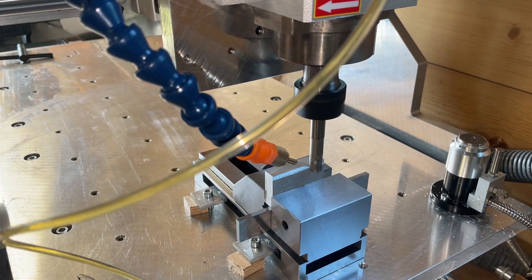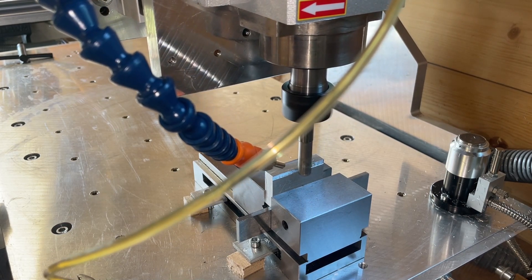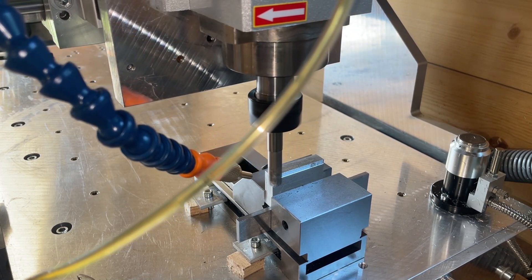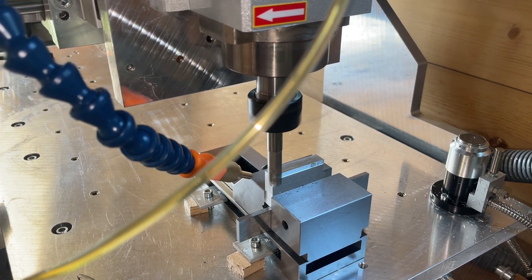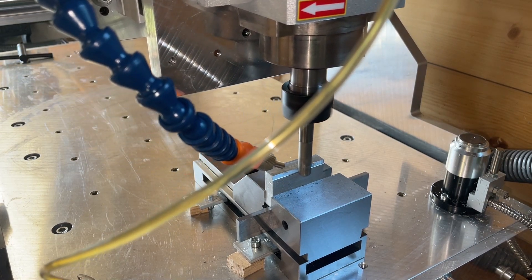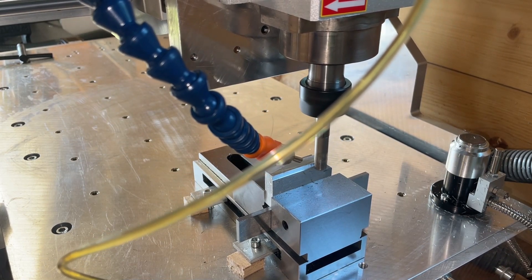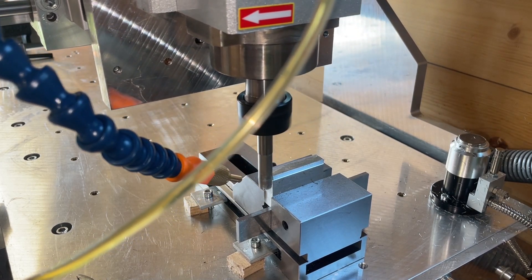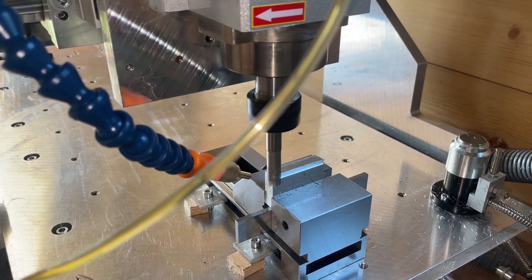Here I was trying out how much I could take. I was milling at 0.15 millimeters and then turned on the cooling. You could really hear the difference the cooling made — everything else stayed exactly the same. You can see the surface in the front is way worse than when I turned the cooling on.